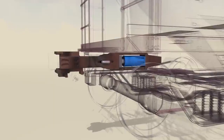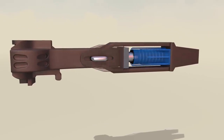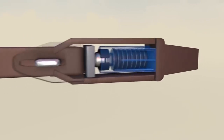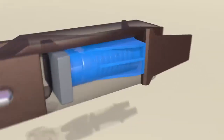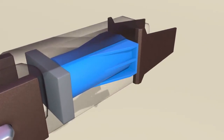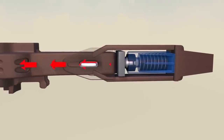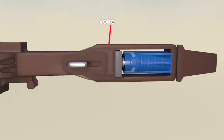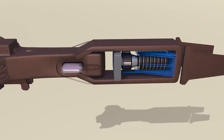The coupler is attached to the draft gear assembly, which provides a kind of suspension between train cars. During impact coupling, also known as a buff event, the coupler is forced backwards against the draft gear. The draft gear's rearward travel is stopped by thick metal tabs at the back. When train cars pull away from each other, also called a draft event, the surrounding yoke pulls the draft gear against a block at the front, causing the internal disks to again compress and absorb potentially harmful forces.